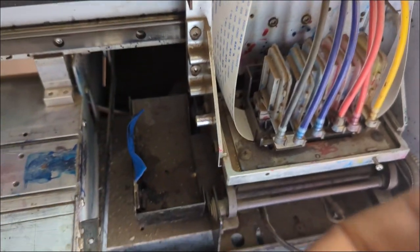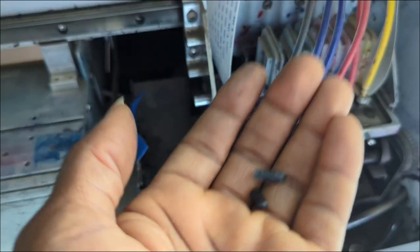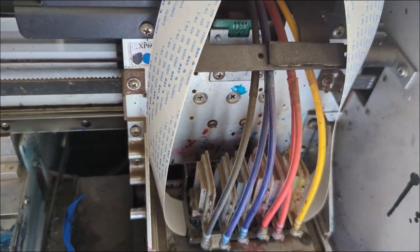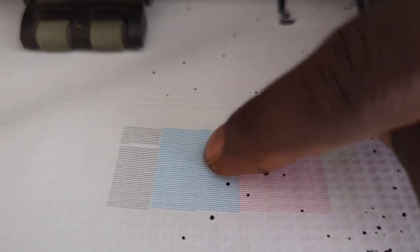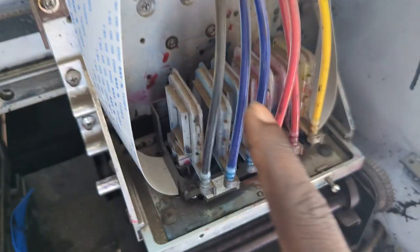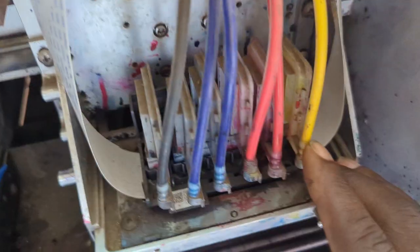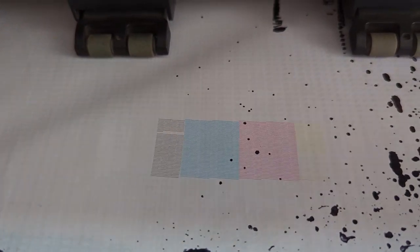To start with, I have made two studs. My current printer head is perfectly fine, but we can use these studs to simulate scenarios where you lose one color. If your machine is perfectly fine, you should see six color nozzles: nozzle one through six. Cyan has two nozzles, magenta has two nozzles, yellow has one nozzle, and black has one nozzle.